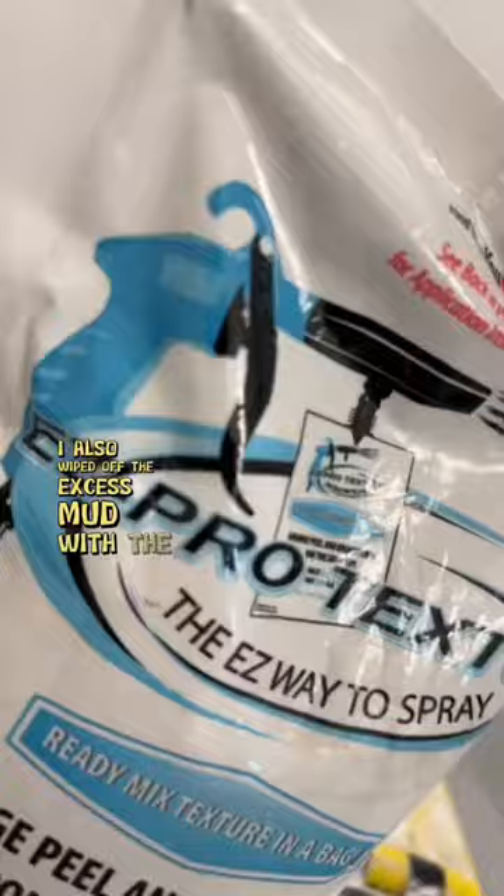After the pre-fill, I'm going to apply some of this fiber fuse tape over the patch. This is going to help strengthen it so that it doesn't crack in the future. Then I applied a little bit of hot mud over the fiber fuse tape.